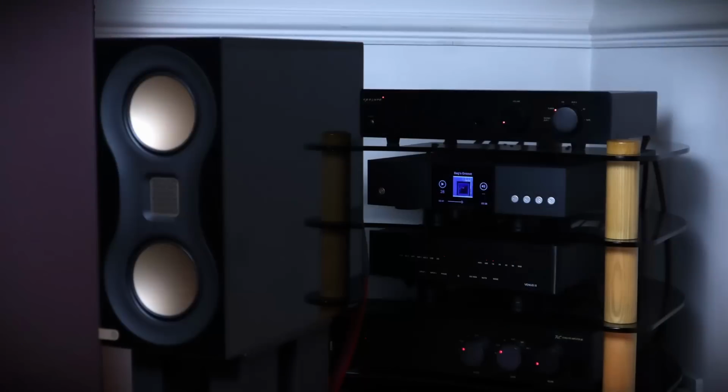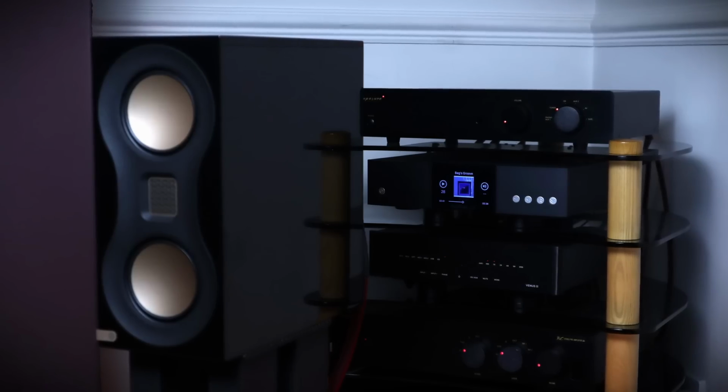The distance from the speakers to the listening position was also critical. That is the reputation of D'Appolito designs. Tonal variations are more obvious as you change the listening position relative to the speakers than a lot of traditional two-way types of speakers. So I maintained a minimum distance of 2.4 meters or 8 feet. They're a lot less fussy about partnering equipment though.